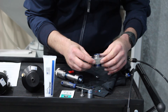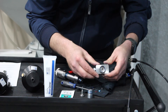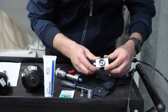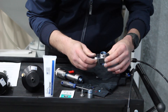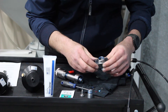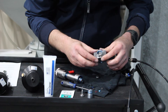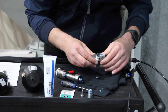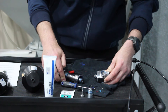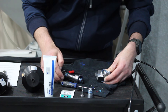The next thing we do is inspect the bore — the length of the inside of our valve body — making sure there are no scratches, as this will cause premature failure of your seal kit. If it is quite scratched and you are having to replace these quite often, you need to replace it with a brand new kit. For demonstration purposes I will simply be using the kit we pulled out, however you would replace it with a brand new kit and it's important to replace every part.